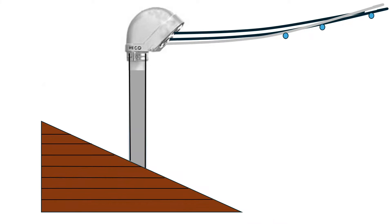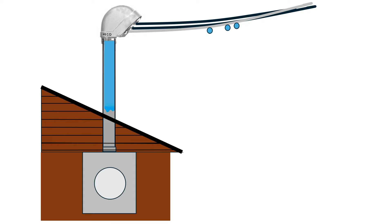Let's look at this animation of an electrical system without a drip loop. As the rainwater runs down the wires, it gets to the weather head, goes into the mast, and eventually to the meter base. This can cause serious problems with the electrical system.